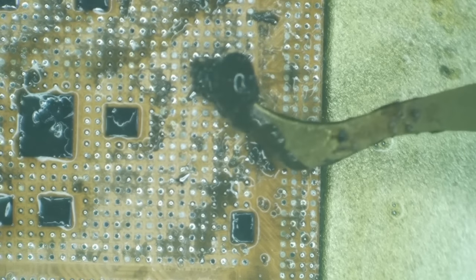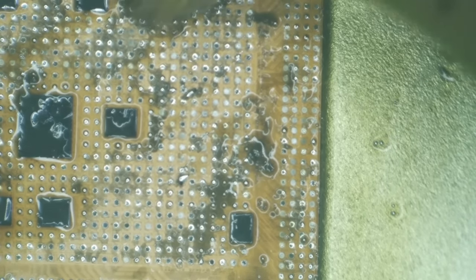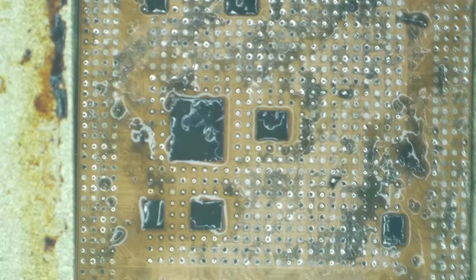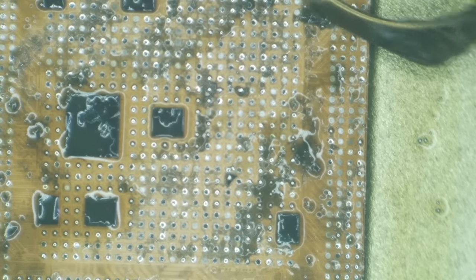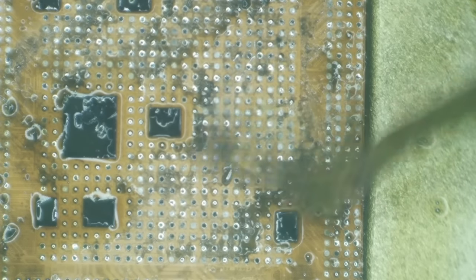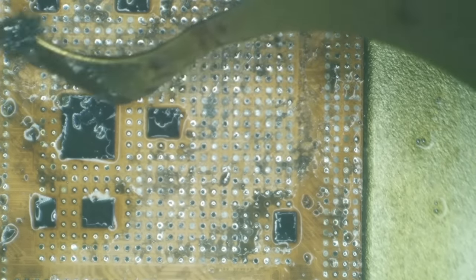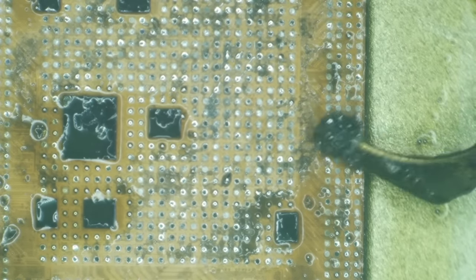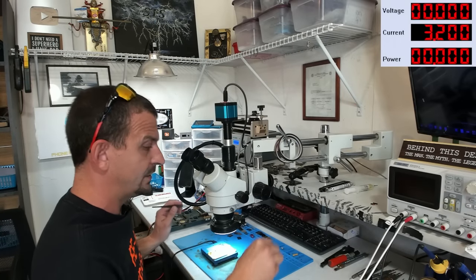Okay, I'm almost ready to switch techniques to a technique that's not quite as stressful. This here is pretty stressful. If you turn your blade the wrong way or twitch or get a little bit irritated or for some reason somebody made you mad 2 or 3 days ago, it's pretty easy to damage the CPU. This part stresses me out. So let's switch to cotton swab.